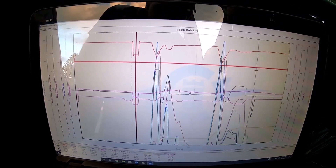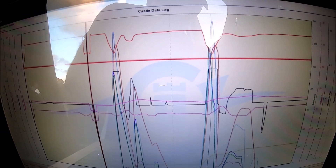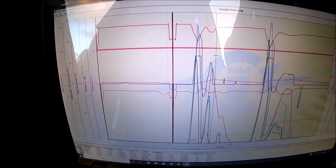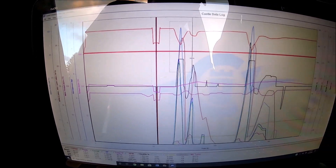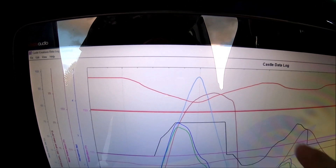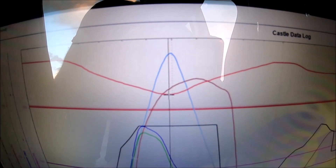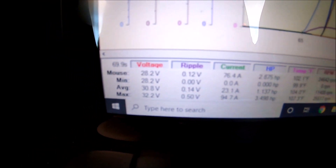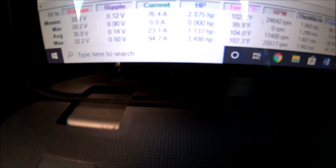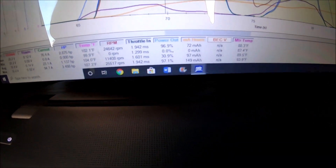Already from looking at this, my eyes go right to the voltage drop, which is this big red line. You can see the second run — which was without the EDF setup — the voltage drop is more. Let's signal out one run. That's our voltage; this solid straight line is our voltage cutoff, so it's pretty much just monitoring our voltage. My mouse is directly on the lowest it could possibly go: 28.2 volts, half a volt of ripple, 94 amps, about three and a half horsepower.